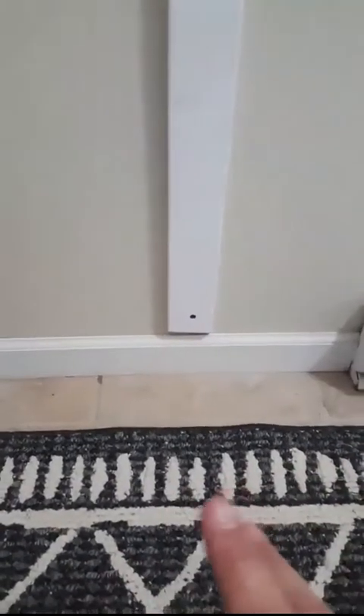So the 45-degree angle at the bottom meets up to the existing baseboard — I am not taking down this baseboard. Number one, it's not old baseboard, and number two, I'm going to be doing the hallway too so I'm not taking down all the baseboard. That also saves money on wood because that's less I have to buy. At the 45-degree angle it meets up to the existing baseboard and it looks really good.